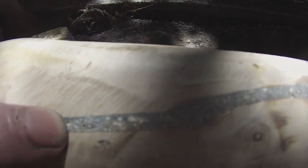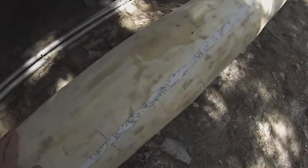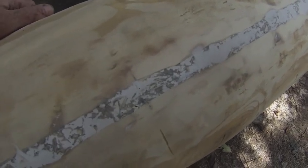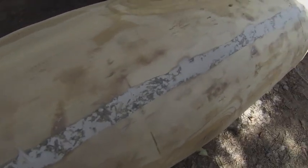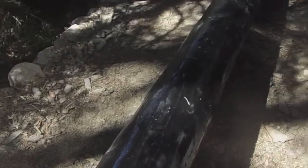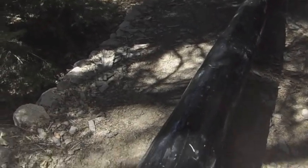This is fiberglass cloth stuffed into the crack and then filled with fiberglass resin mixed in with sawdust. Down here it's different — starting from here it's fiberglass resin mixed in with the shredded wood, and then I filled it in with some body filler, some Bondo, and sanded it all down. Here's the latest version of the mast — I painted it black. Right now it's glossy, but this paint will dull in about a month and it'll look a lot better.